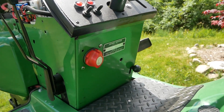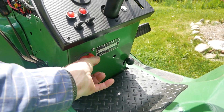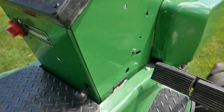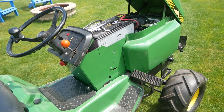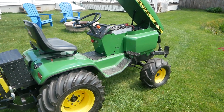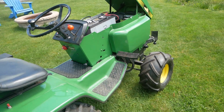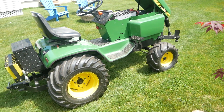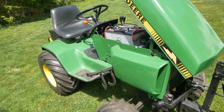This is the dead man switch. This switch right here shuts everything off and turns everything on. To start the tractor, we simply turn on the dead man switch, make sure the brakes are engaged — I don't want it riding off into my little pond over there — and then we start it. Surprising how noisy these hydraulic pumps are when there's no gasoline engine. When you're underway and moving, it quiets right down to like nothing, but when it's idling like that and straining, you'll have some noise.